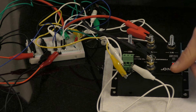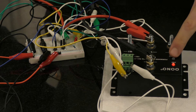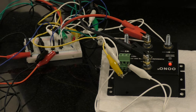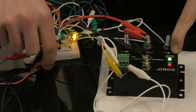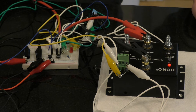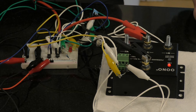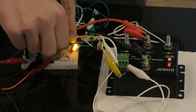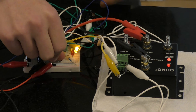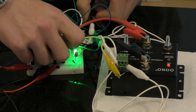Okay, so here's my attempt at explaining what I did today. Over here we have the relay — this solid red is showing we have power. Then we have an indicator of whether the motor is running the gear down or running the gear up: red is running gear down, green is running gear up. Over here we have LEDs showing the position and if it's in transit. If I put the gear selector to gear down, it's in transit — that's the yellow right here — and we know it's going down because the relay is showing the red light. Once it hits full down it's going to turn green: green means gear down, ready to land.